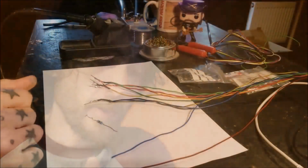So I think just looking back at those, and bearing in mind that's in daylight, so obviously my main beam's on during the day. It's not a major issue, a bit brighter, but it's night time and it's actually blinding to my eyes. So I'm going to go with the 300 because I think even in a darker situation you're still going to see that that's on. And yeah, it's not going to be any drama. I'm just literally going to solder it into the wire, sleeve it with heat shrink. Job's done. If you want to change it, it's a case of just pulling the heat shrink off, unsoldering it and putting a different one in. So that's what we're going to go with first.